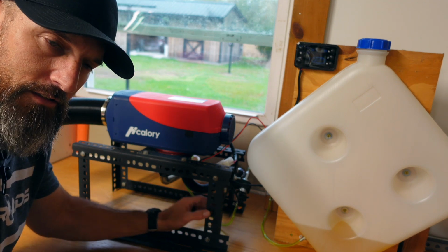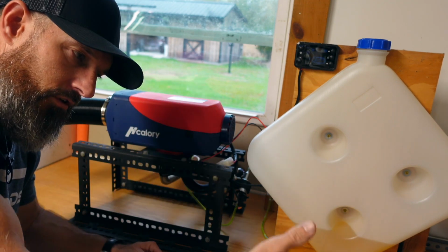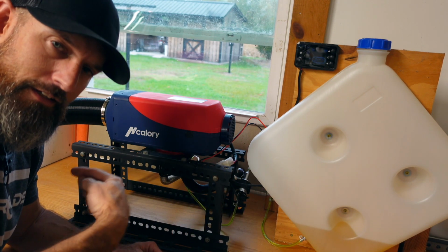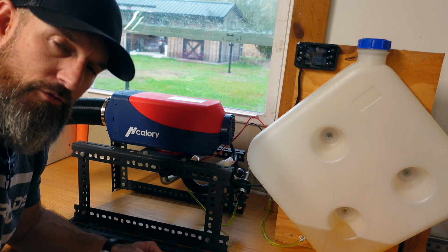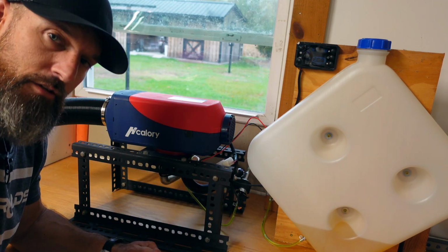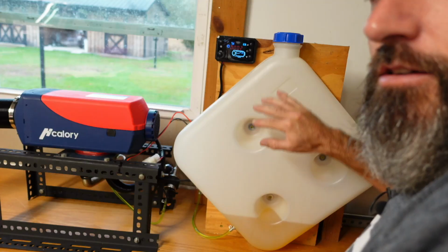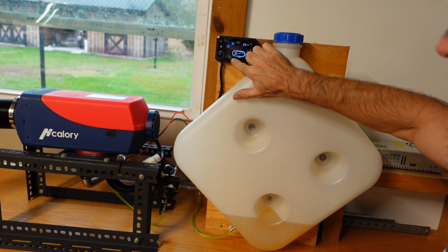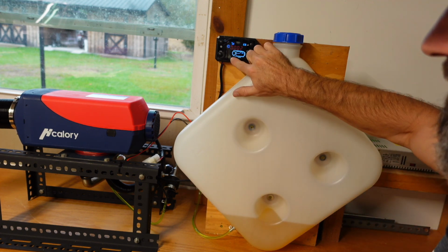That way, because like I said, if you have that really long fuel line, you'd have to turn this thing on and off the way I did it, probably 3, 4, 5 times or something like that. So you can manually prime that by just pushing. You push these 2 arrows and it will start priming. You're going to see your little fuel pump start priming.